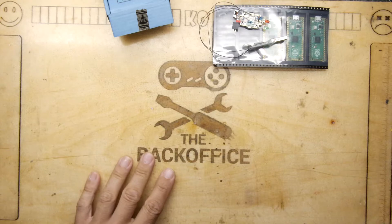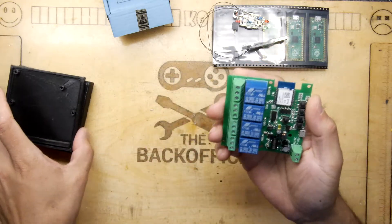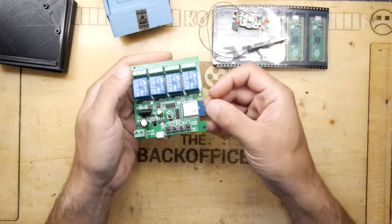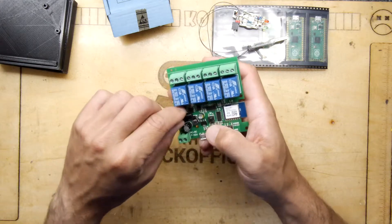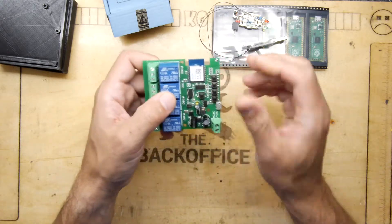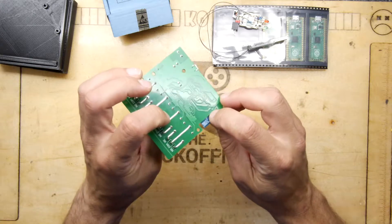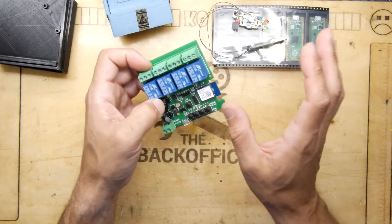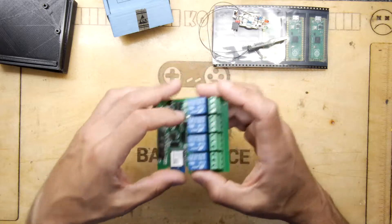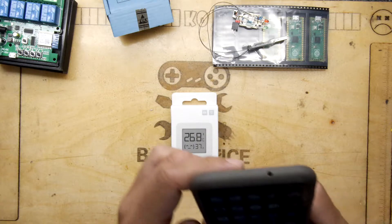The one thing with this chip versus the Pico is it's not a convenient breadboard footprint, but there are adapter boards around where you can solder it on with standard footprints for surface-mount components. Now, we also picked up this board a while back which I've yet to use — it has a standard ESP12 module on it, which is very ubiquitous. Cutely, it also has an RF learning stage which lets you learn from remote controls — great for garage door or gate openers. There's also an open-source IoT project that provides a smartphone app and lets you program these chips so you can run your own infrastructure without relying on third-party Chinese cloud services.